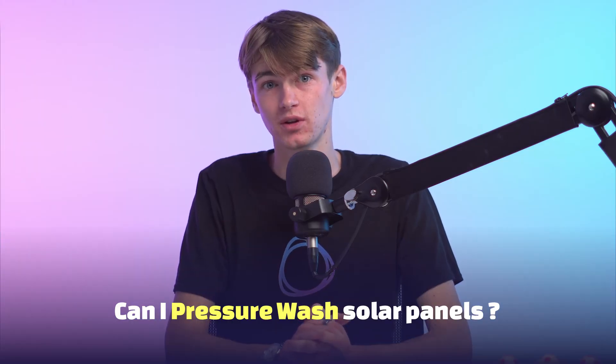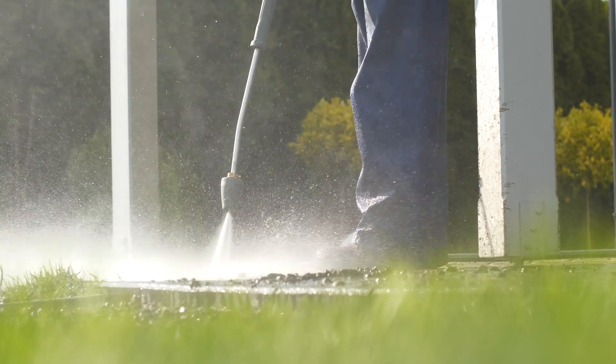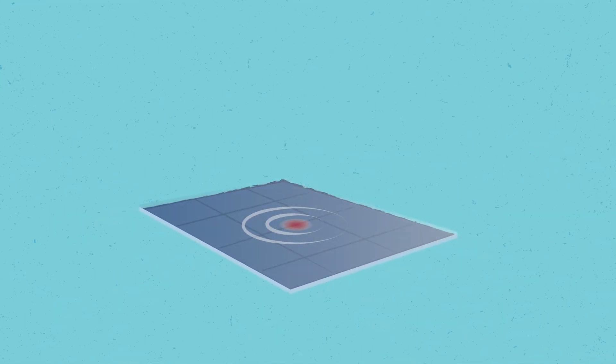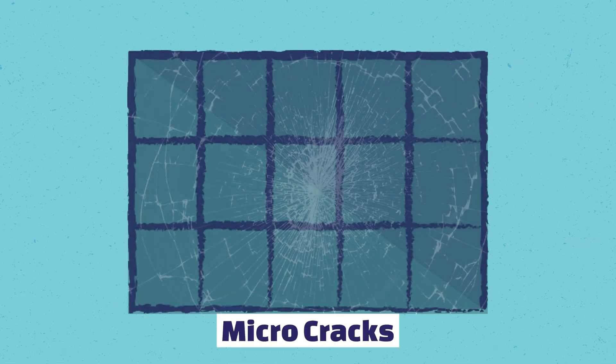You may well ask: can I pressure wash my solar panels? If it works for my concrete driveway and garage, why not use it for my panels — that way I can get into every corner and crevice. Well, solar panels are solar cells aligned and then laminated, after which a piece of tempered glass gets put on top. Under high pressure washing, if one focuses on a particular spot of the panel, the glass can put pressure on the cell below, and these cells are quite fragile and very susceptible to cracking. So an aggressively cleaned solar system could be riddled with micro cracks after even just one high pressure cleaning.